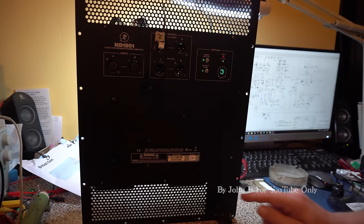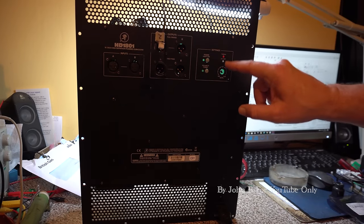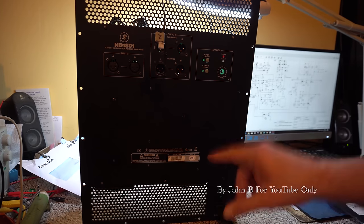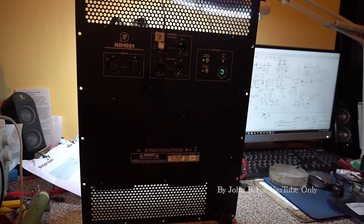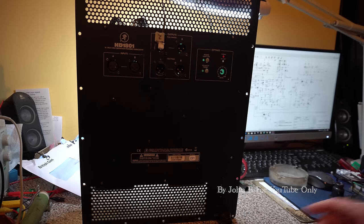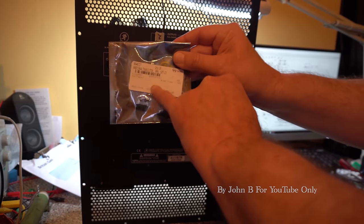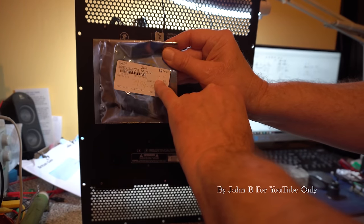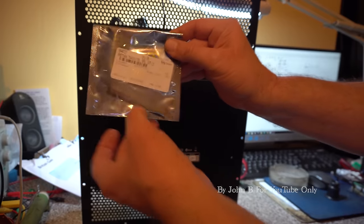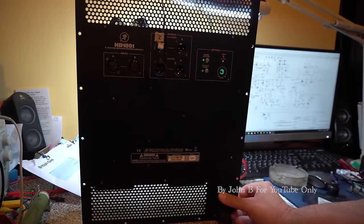Right, here we go. There's the mains. So as I say, I used to have the thermal and the signal limit light on, and there was nothing else, but I've just swapped that incorrect transistor, stuck in a 3904, it had previously probably been a 3906, so you should mark your components. These are 3904s, and the marking on them, 1A, so if I ever lost the transistors out of the packet, I can identify them. Here goes nothing.